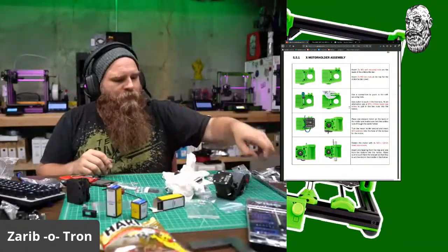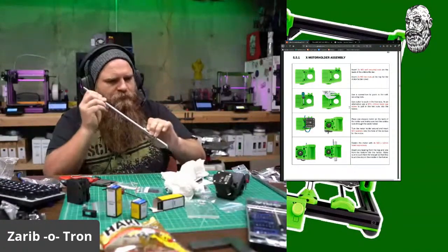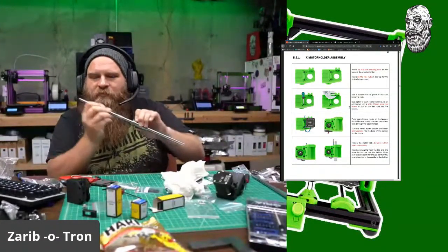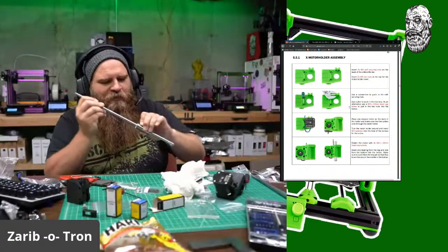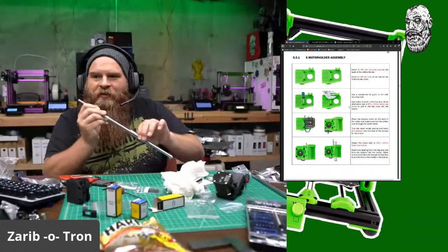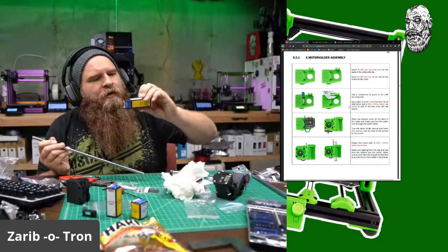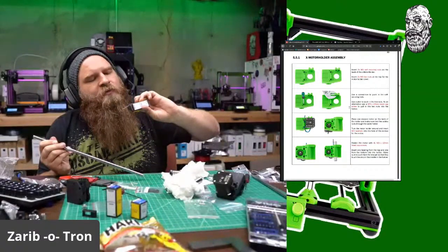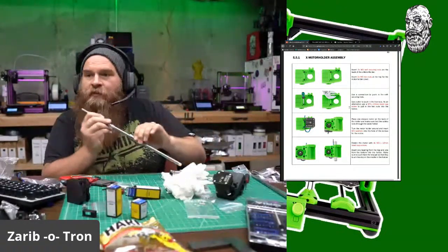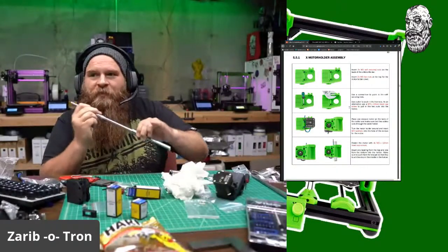Let's run it on these rods real quick to get most of the grease. Do this until it's smooth rolling. Starts freeing up once you get it all on the rollers. Let me double check. These are LMUW, so they are single sealed. Two U's would designate double seal usually. There we go.